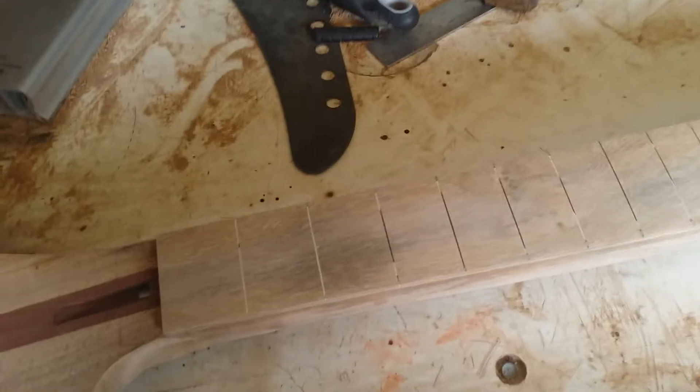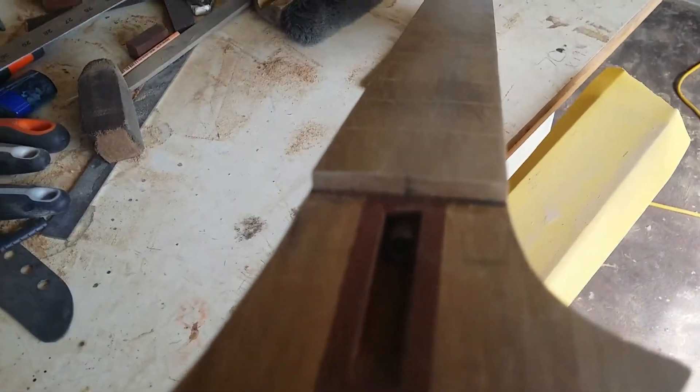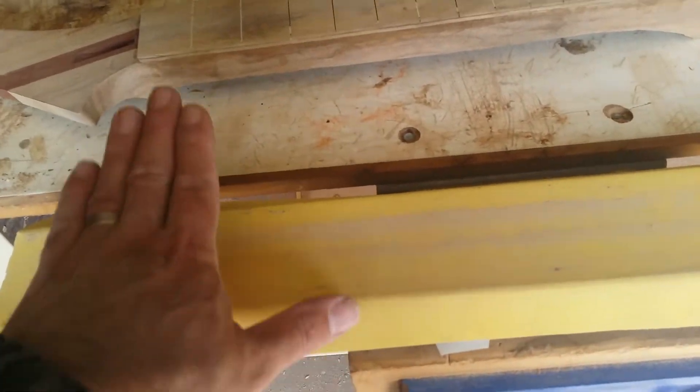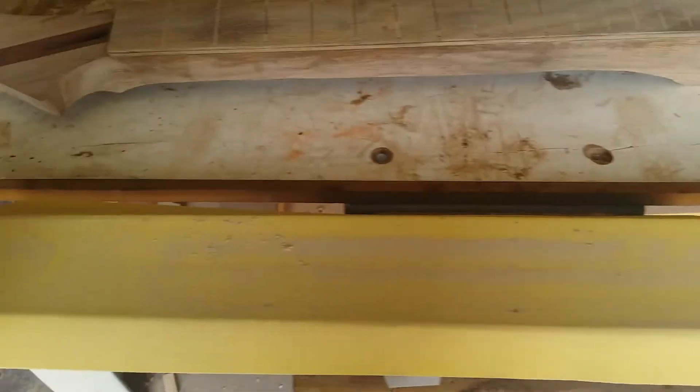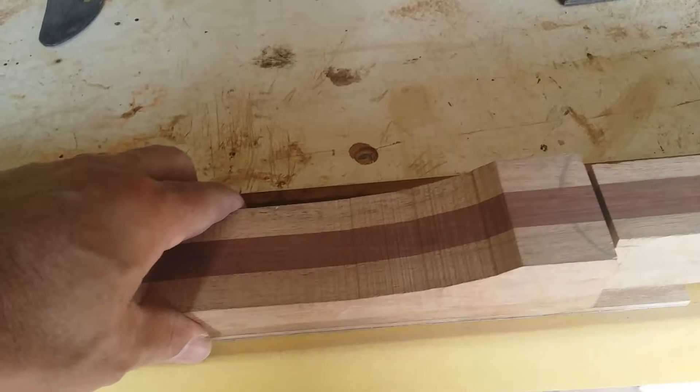What I've basically done is put my head down and started fabricating another neck. Got a little bit further along with this one — got the fretboard on. Still got a lot of work to do. I just put the radius on the fretboard; there's a little radius on the fretboard there, probably a 12-inch radius. I basically made this piece of steel up here with a concave radius of 12 inches, glued some sandpaper on with some double-sided tape, and then just ran the actual guitar along like so. Got it sanded down, so I've got that pretty close.